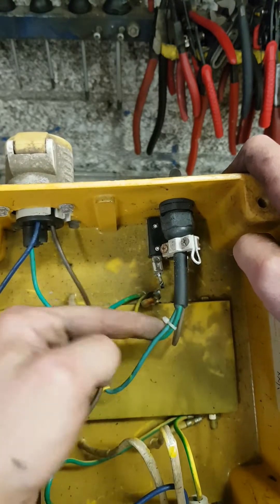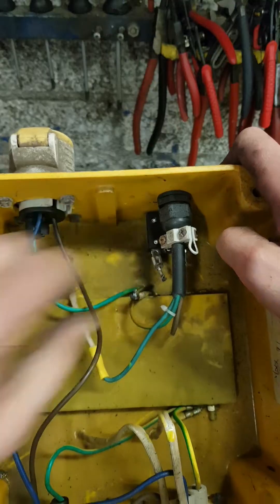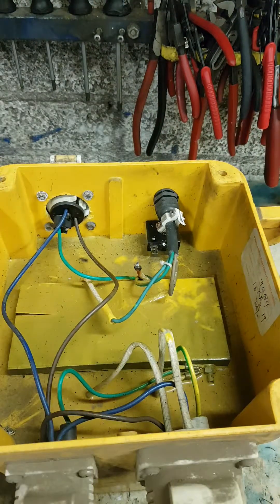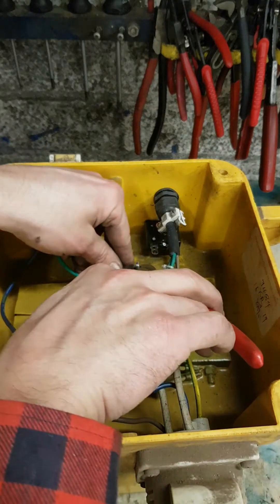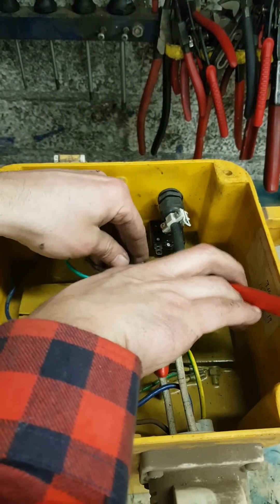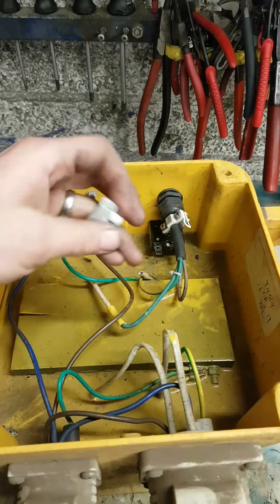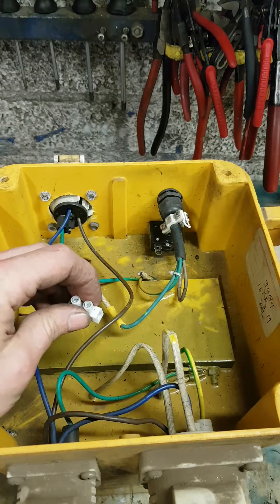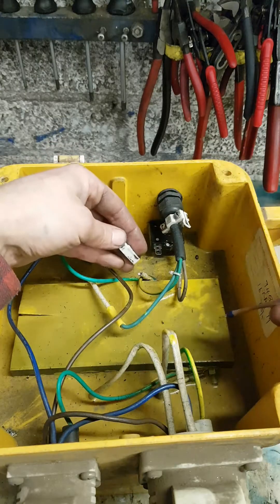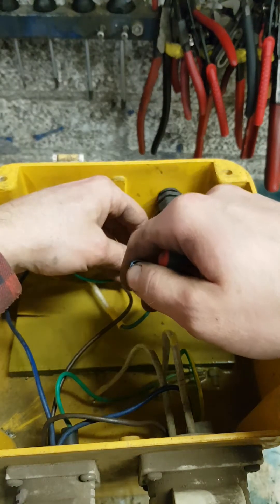I think we'll put an extension onto that to get heavier wire, before looping it back, because that's not much meat there at all. I'll cut it off that bad bit. Strip connectors isn't something I use too often down here, but for this application you have a better hold for a very stumpy wee wire. If everything does need to be changed again, it can be easily removed without making it any shorter.